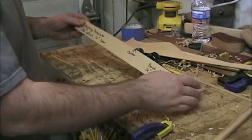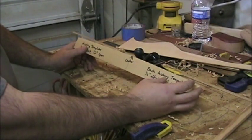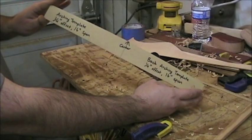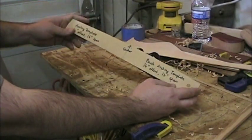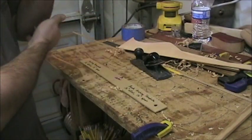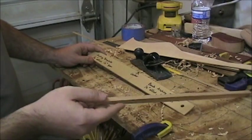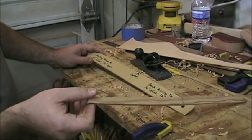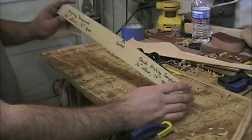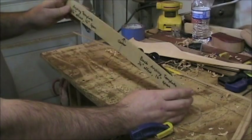If you have any questions on the templates — this one is a quarter inch offset over 16 inches — you can go up to a half, you can go as little as an eighth. On the top, I think mine is an eighth inch over 16 or 20 inches, something like that. These can also be found online — you can find basic arching requirements. Whatever the length is, put your pins at the end, mark your offset off the straight line, bend something to make the curve, and make the template. Take your time on the template and make sure it comes out nice, because everything you make is going to be from this template. You don't have to plane them — you can sand them, or cut most of it on a bandsaw and then sand it. The plane is pretty quick though it takes a little bit to get the hang of. If you have any questions about arching templates, shoot me an email at sixgunguitars@gmail.com and I'll go ahead and answer everything I can for you.